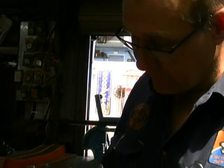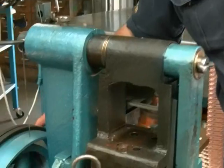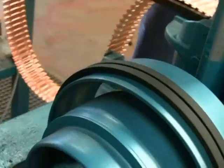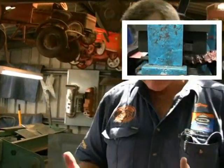This little machine was built in Sydney in 1930. It used to be operated by Johnson Brothers at the same address where I bought it, on Parramatta Road, Ashfield. We've extensively restored the machinery — re-bushed it, re-bearing, new motor, new gearbox, everything that had to be done. Inside here we have a tapered cone cast iron clutch, much like veteran cars actually. When you pull the lever, it engages it, and the weight of the flywheel keeps it going. As you can see from the die, every time it comes up it coats and pushes it through.